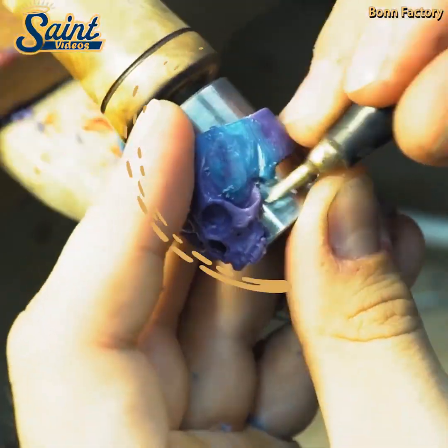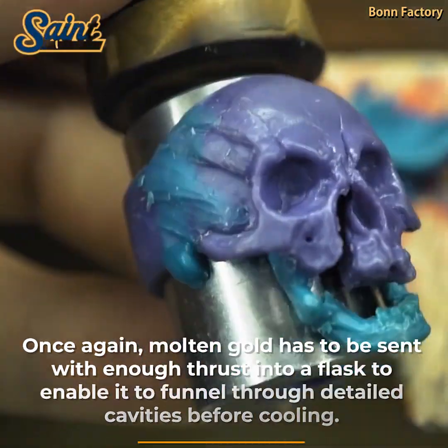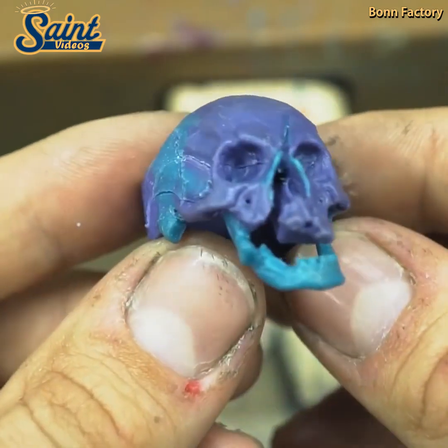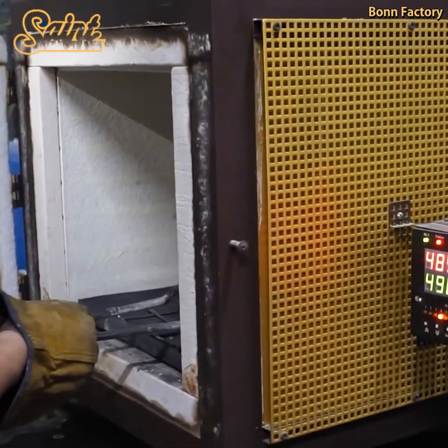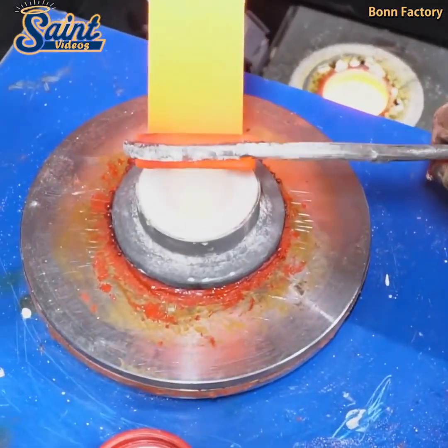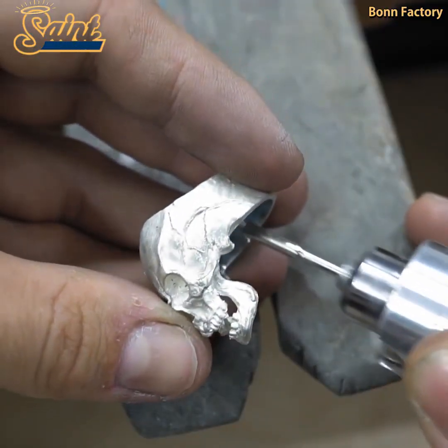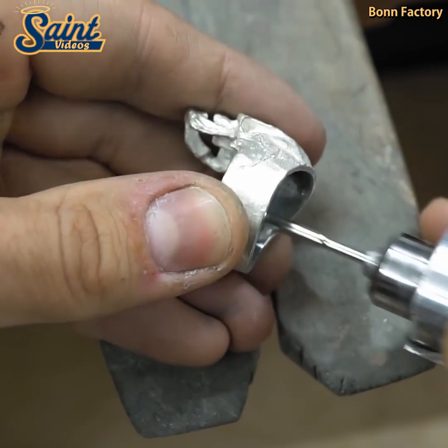The intricate cavity is then filled by molten precious metal. Gold casting and platinum casting procedures differ greatly. Platinum melts at such extreme temperatures that specialized skills, equipment, and plaster investments are needed. Since gold casting encompasses a wide range of carats and colors, the alloy combinations dictate that each has temperature cycles and processes unique to the metal.